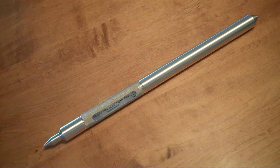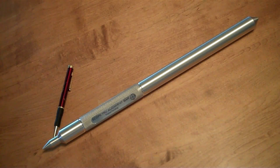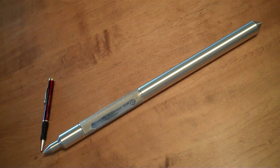Let's begin by pointing out a few of the final changes made to the Scope True Bar. The reduced diameter cylinder on the front pointer is easy to line up on the barrel, and it is designed to work with barrels from a number one contour on up. When the pointer is centered on the barrel, there is an equal amount of barrel showing on each side of the reduced diameter cylinder. The tip of the pointer has been blunted to make it much safer to use.